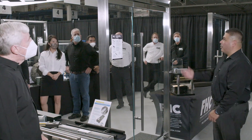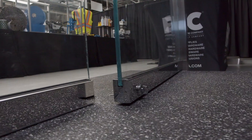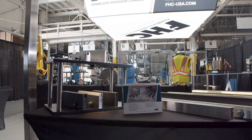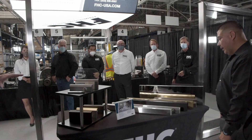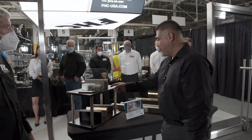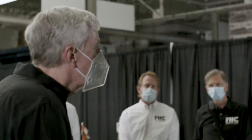The new FHC Herc door is a low-profile system giving customers flexibility to use a full-size arm and full-size bottom pivot — that's with the two-and-a-half inch top — and it has a 1/16 inch tight radius corner. We have our low-profile patch fittings: four-inch patch fittings in tapered and square profiles. We also have our PV6 adjustable system, which allows the customer to adjust the door in and out once installed. These are available in all architectural finishes: polished brass, satin brass, polished stainless, brushed stainless, clear anodized, and dark bronze. They also have die-cast end caps with an anti-clamp, UV-resistant finish.